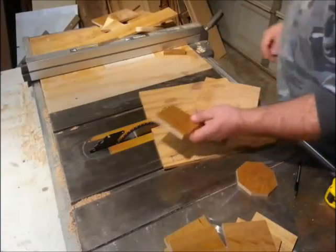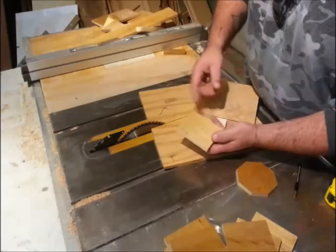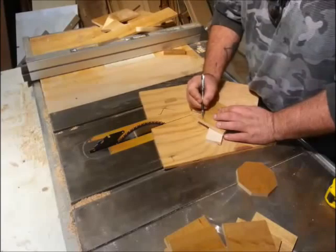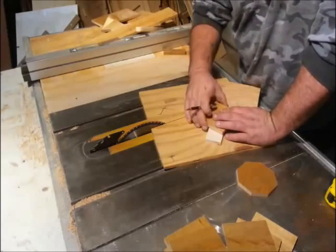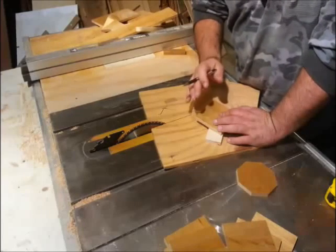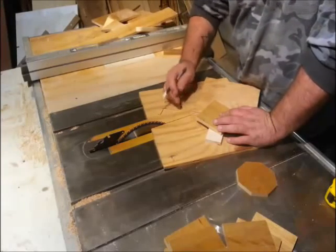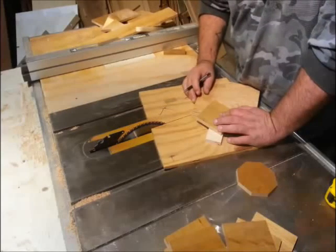Now that I've got all my four-inch by four-inch squares cut out, I need to relieve the edge of each side to make my perfect octagon. I know that from this corner I need to measure back one and three-sixteenths of an inch, and that'll give me a perfect octagon with a four-inch square. If you want something a different size and you're not sure about the math, there's a website called pagetutorials.com — I'll put a link below — that has all kinds of generators for many different geometric shapes, and it's a real handy tool.